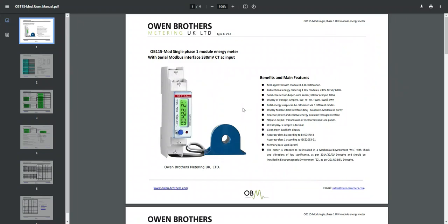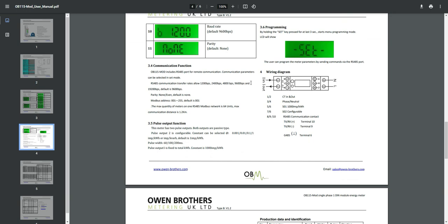Welcome to my channel. Today is Home Assistant hardwire part 5: electricity meter. This electricity meter comes with a core sensor, so you just push your live wire from the equipment you want to measure. Don't push both neutral and live — just live. If you can't use live, you can use neutral. There are terminals for RS-485 bus, a pulse output you can connect to a digital input to count pulses, and the core sensor output.